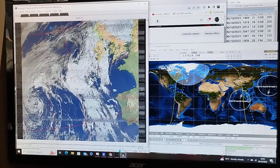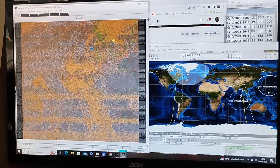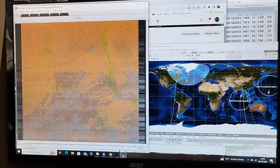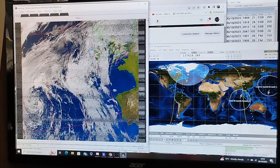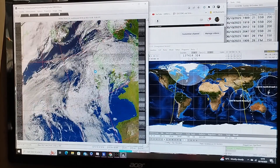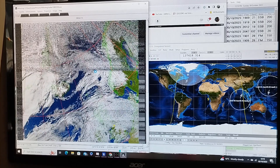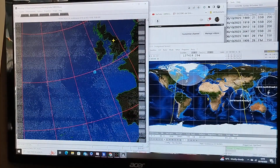That's the result as we're seeing it live from the shack of M0YKS — it's looking quite successful. Good reception. That's the infrared side of it showing you where the cloud is containing moisture. That's the enhanced colour end result on NOAA-19 — I'd say that was more successful than the earlier video I made.